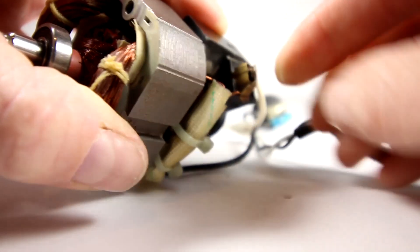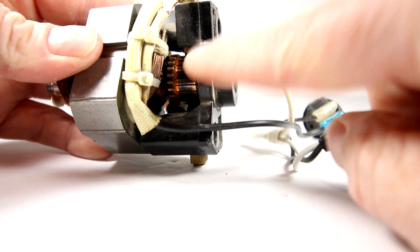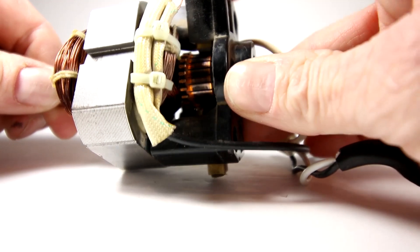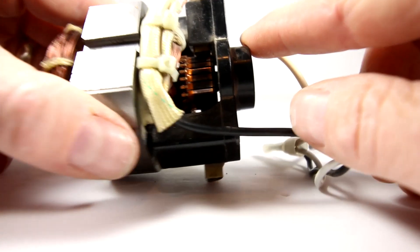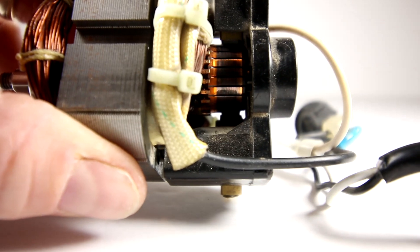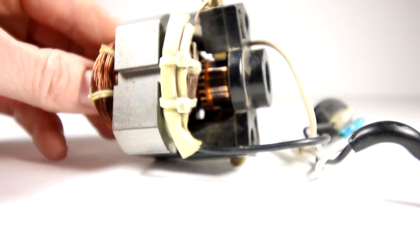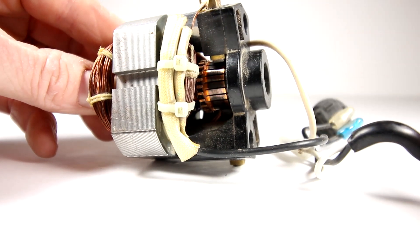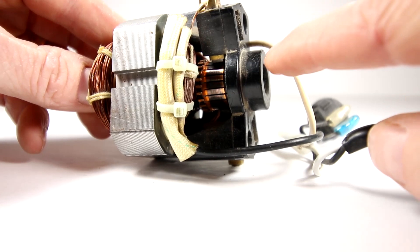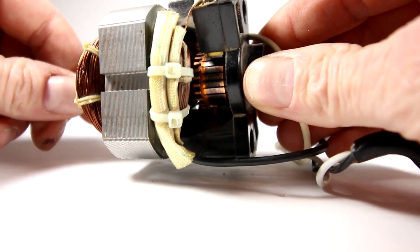Right there is a spring that is pushing down on the brush and allowing the current to flow into the commutator and the armature. The armature is the whole inside portion of the motor. By placing current to that point, there is a brush right here and a brush right there. You can see on the actual commutator there's a little bit of black there. That's not from arcing — that's just a fine film of the carbon graphite from the brush being placed onto the commutator.